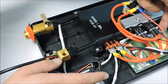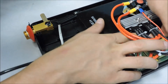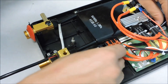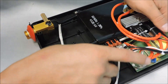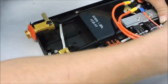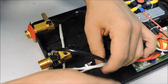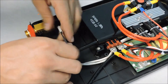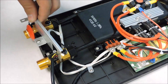Disconnect the flow sensor from the PCB port labeled 'water' and remove. Weave the new sensor under the power wires and plug back into the corresponding port. Be mindful that the plug clip can only be installed in one direction. Before reinstalling the inlet, twist the inlet temperature sensor wire counter-clockwise about three times to prevent the wire from twisting during installation. To ease installation of the bracket, put the screw in the center hole before reinstalling the bracket. Make sure to install the second screw.